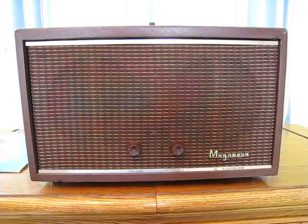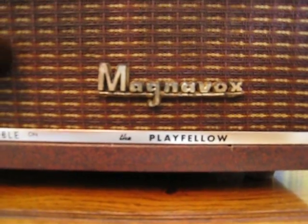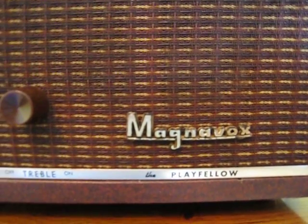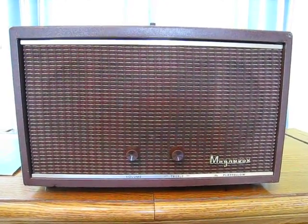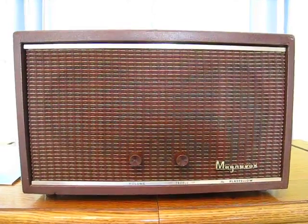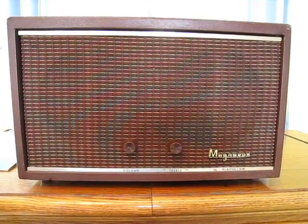This has no radio in it — this is strictly a three-speed player. If we look in the corner here, this is called the Magnavox Playfellow, and the model number is TP255MA. The treble control is also your on/off, and there's the volume control. In the front we have two rather large round speakers — I believe they're six inch — and it's got a pair of 6L6's feeding the amplifier, so it's got plenty of power and really nice bass, surprising bass for a tabletop unit. It's almost more like a freestanding floor model — that's how nice the sound is.